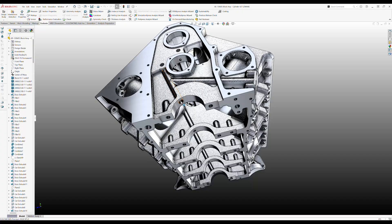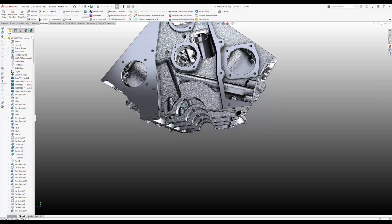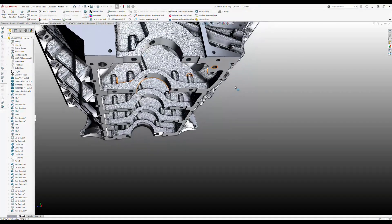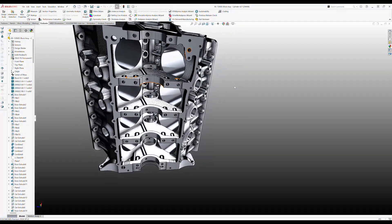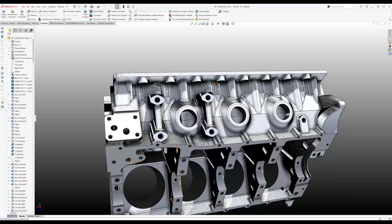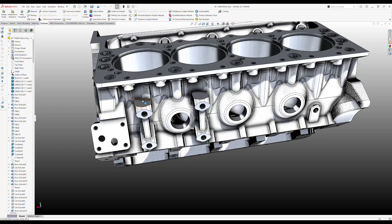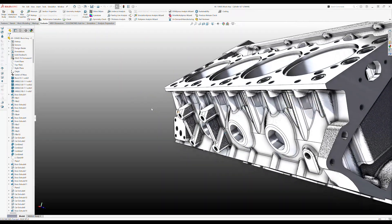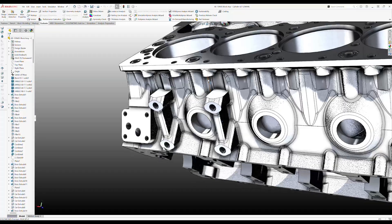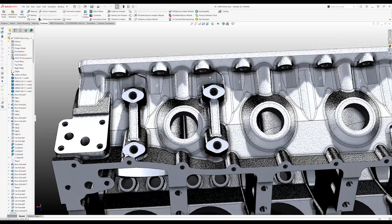Probably because this oil galley gets primary feed from right here, and the mains. There's a cutter comes in and this casting extends upward, very similar to what this looks like here. But of course you've got to have a cutter come in and clearance for the bolts — or I should say the nuts and studs that will exist out here.